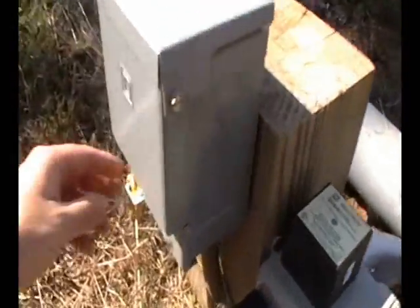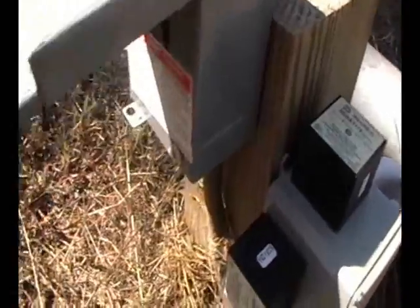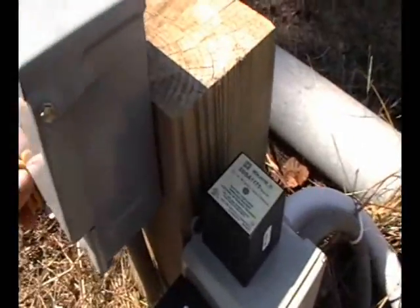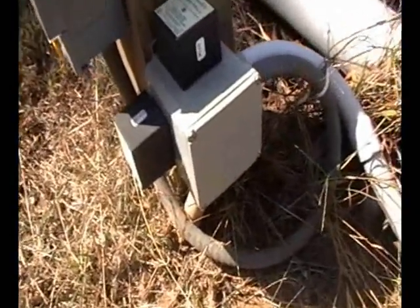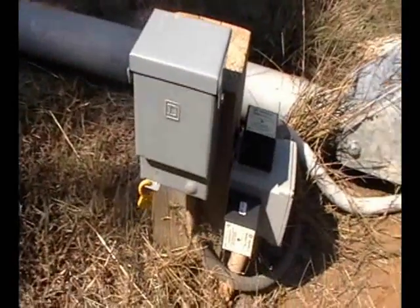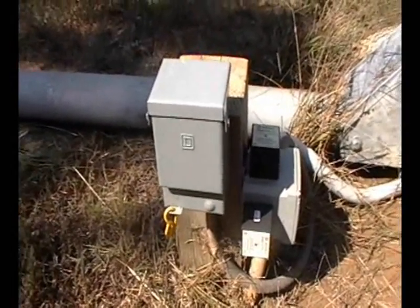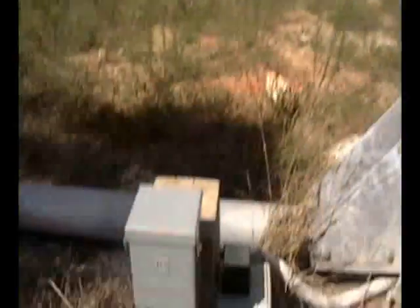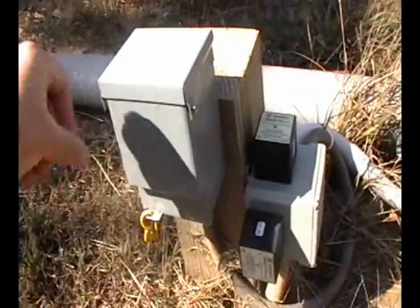Now this disconnect here — basically it's wired up with a breaker. It is wired so that when you turn the breaker on, it shorts two of the power wires. Basically what that's for is an emergency shutoff, because when you ground two of the phases together — or all three of them together — it basically stops the turbine from spinning. So this is an emergency cutoff for the turbine.